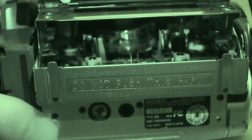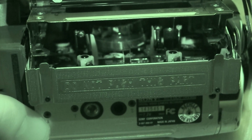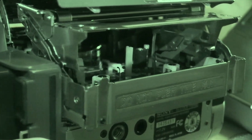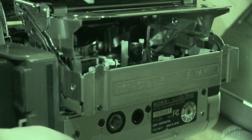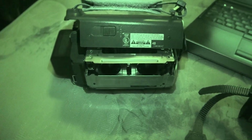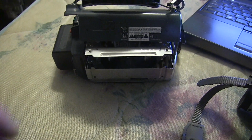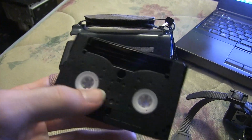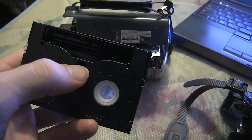Looky there, we're missing something. There's supposed to be something mounted inside of that little bracket there. Also pertinent is that ribbon cable that's sticking up that seems to be sheared off at the very end. That ribbon cable is supposed to connect to the infrared sense piece that sits inside of those little metal things. Yes, those metal things do line up with this little hole on an 8mm cassette.